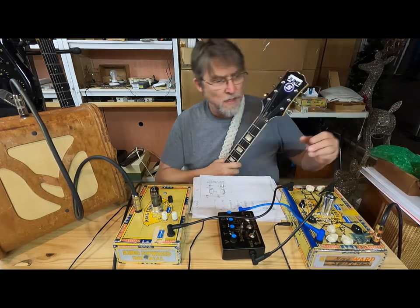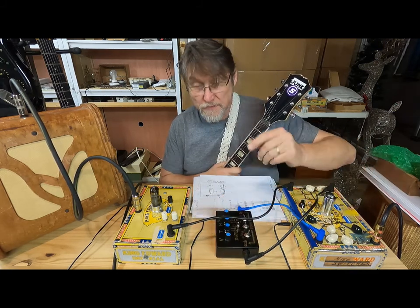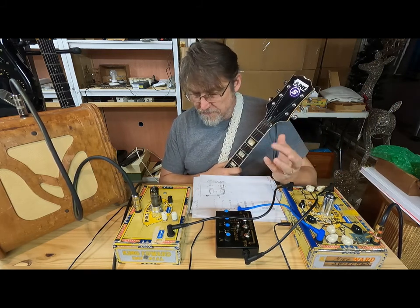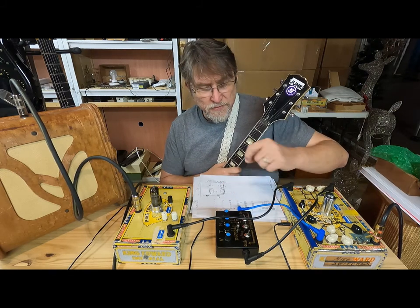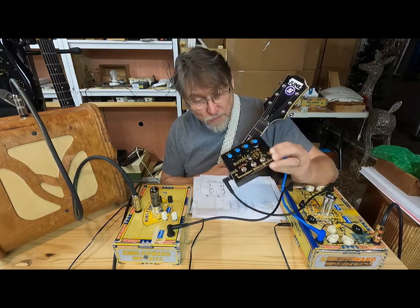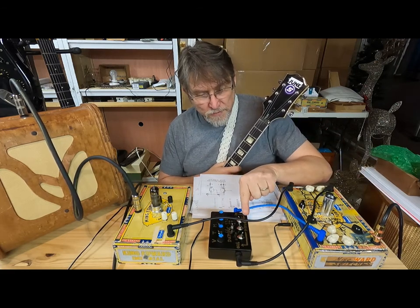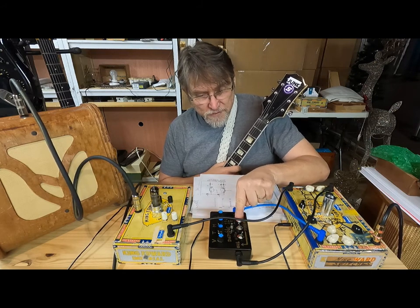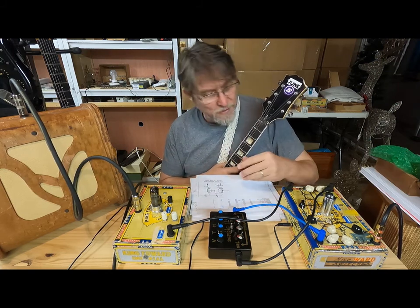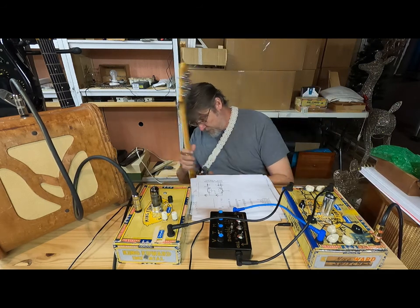Fender Princeton uses the gain stage 1 and 2, where gain stage 1 feeds into the tone stack. This is nothing like the Princeton tone stack. What it is, it's closer to a Fender Marshall treble middle bass. If you can make out this, it says Dumble 124 and Dumble 102, but I've added a magic switch in here that goes from Dumble, and the other setting, which is what it's in now, is the everyone else setting. So you can either be a Dumble or everyone else. Go figure. All right, turning this thing on. Let's see what it does. All righty.